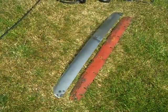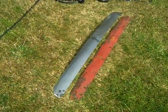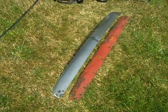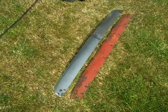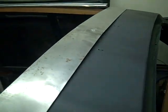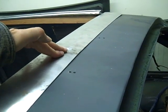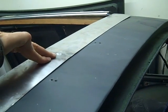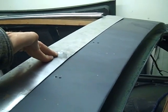Now all we've got to do is cut it to the right length and join the two parts together. That's now the final piece welded in the middle. We've got slightly more of a curve than the other part, but I think ours is actually slightly more correct because I think the original bit had probably been slightly bent. We just need to put the elongated holes in and find a way of countersinking them across the length of the hole as they are in the original one.